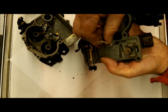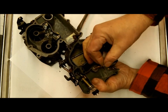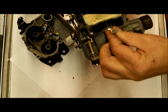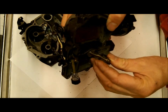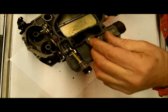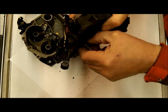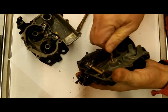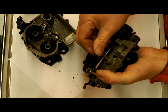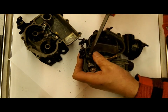Now this stem — be careful with it, you don't want to break it. You can't buy these. This needs to go up and down easily. I don't recommend actually removing these because of the possibility of breaking it. For some reason it looks bent, but I think it's an optical illusion. They're kind of staked down here and you have to grind on it to pull it out. I have a good ultrasonic cleaner, so I don't necessarily have to take that out. These have to move freely — this one's real sticky, and that's not good. Hopefully cleaning will fix it without taking it out.